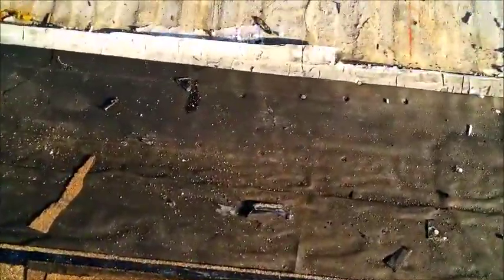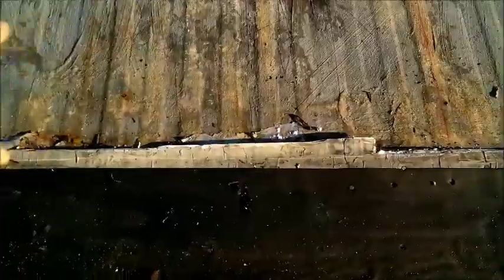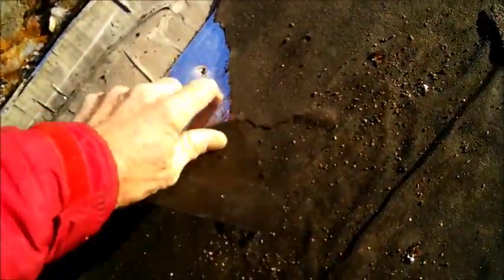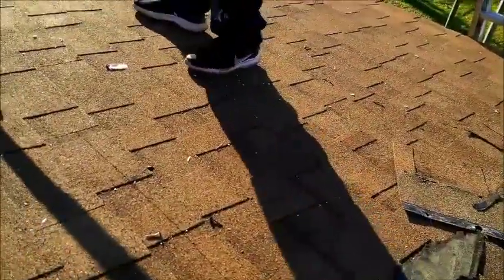Yeah, so you'll never stop this thing from leaking. Just imagine you got your roof right here, and then you tie a porch into it and you run shingles, or roofing, plywood, whatever, just butt it up against the trailer, and then you run felt paper on it, which is this, and then you put shingles on it, again, over the top of that. When there's no pitch at all to start with, you're going to run into trouble. There's no way you're going to seal that off, and they couldn't seal it off either, obviously.